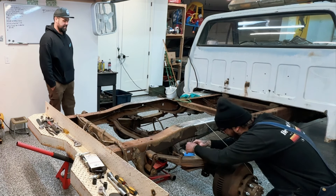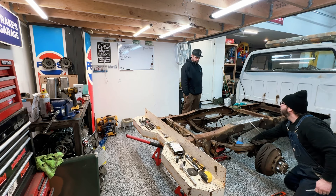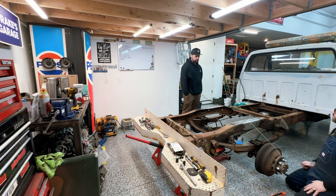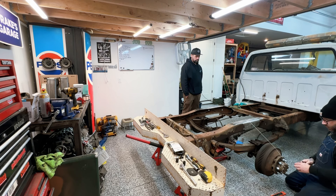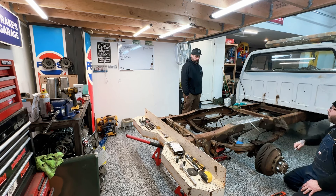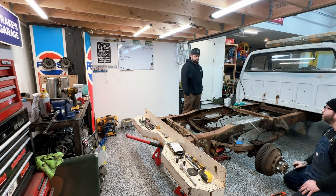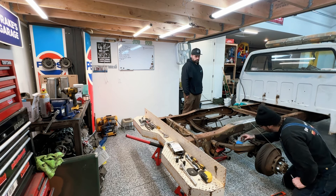There's my cross right there. I'm also going to plumb bob around the axle onto the ground, just in case I lose my references — I've got other references to go off of. This is where you take your time. Spend the time to do this. I don't care if it takes you two hours or two days. All your data is based off of what measurements you have here. The longer you take to do all this, the better it's going to be.